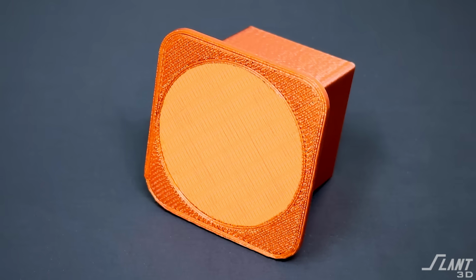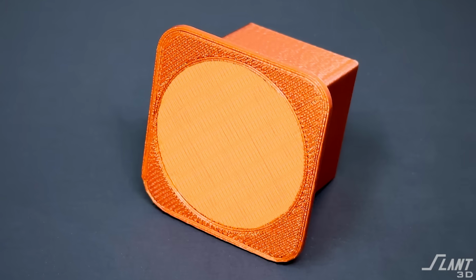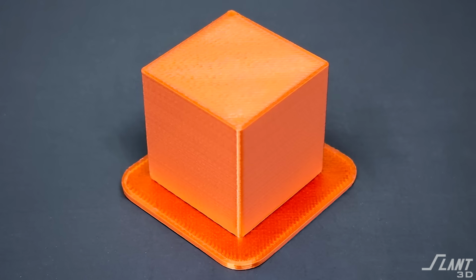And you can play around with these patterns. We could probably do another video where these patterns can be very explicitly designed, because there's a lot of really cool stuff you can do with zigzags and that kind of thing that can really improve this. But that improves the raft first layer so that it's reliable, sticks down to the bed, but it's still easily removable, but still also holds down as well. All of these factors that you're playing with.